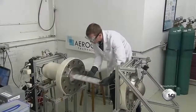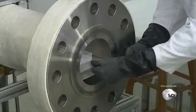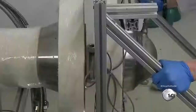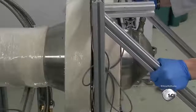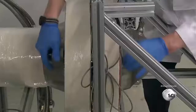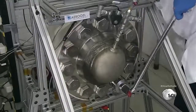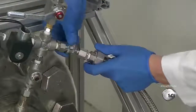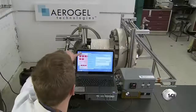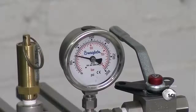Supercritical drying is a process that will convert the silica gels into aerogels. A technician places the gels in a pressure vessel. He locks the heavy steel lid with 12 large bolts and nuts so it will hold tight against a pressure 100 times greater than that of the normal atmosphere. He connects the hose that delivers liquid carbon dioxide to the vessel. The liquid carbon dioxide replaces the methanol in the gel's pores, and they then heat and pressurize the gels until the carbon dioxide becomes supercritical.